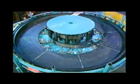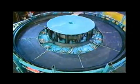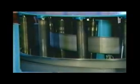As strip is removed from the accumulator, convolutions on the outside diameter automatically transfer to the inside diameter. Once the strip reaches the inside, it will automatically climb up onto the stationary idle rolls. Reverse bending of the strip is eliminated, which decreases wear and stress on the accumulator components and strip, reducing maintenance and assuring maximum productivity.